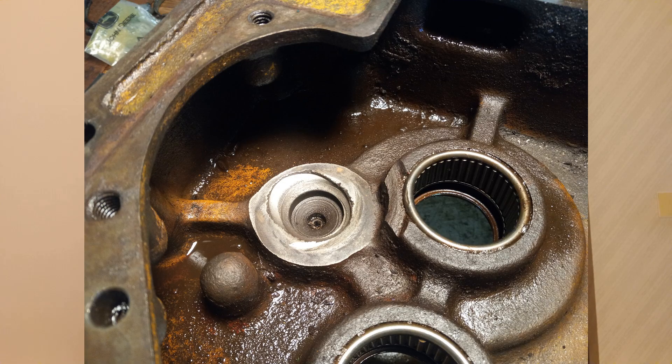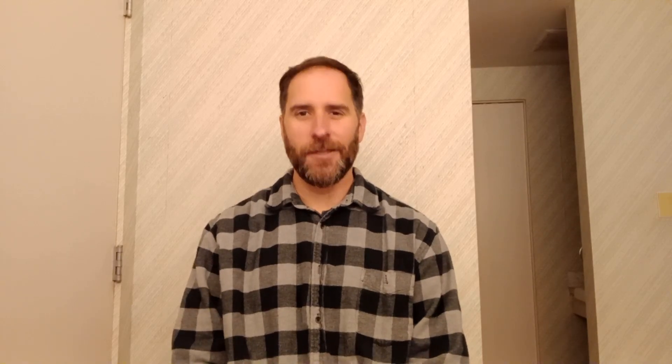You can watch the video on how we got the tractor and on the first repair. The failure happened again, I think because the metal was wallowed out where the intermediate gear's pin sits in the housing — on one half of the housing. So this time I'm going to try to weld that up and put it all back together.